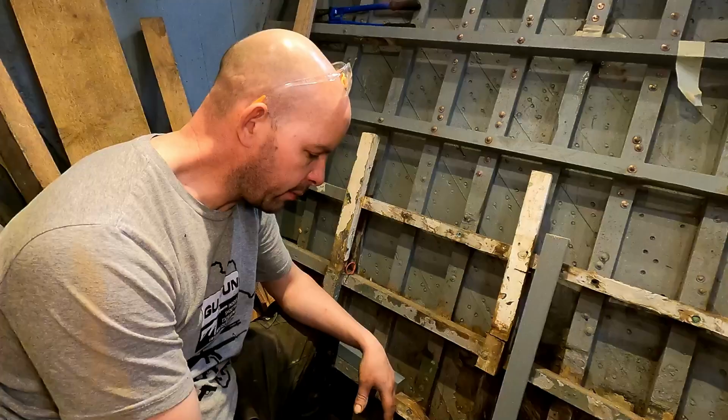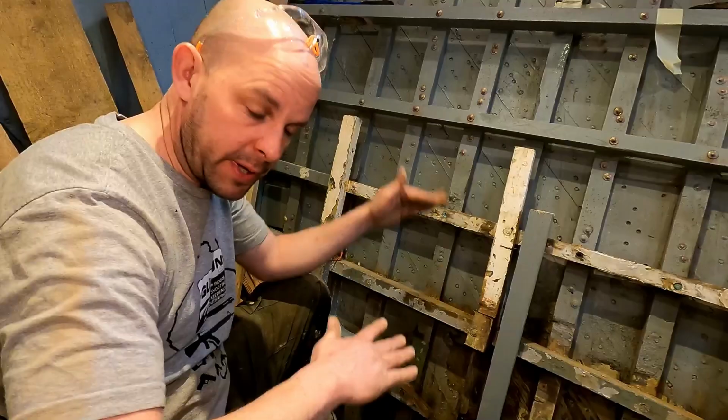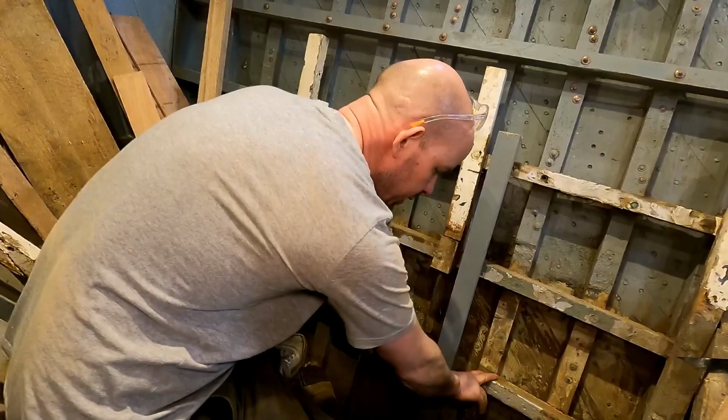So it's not completely rotten, that one, but it's very difficult to change down there because of where we are and the mud and stuff. So we can actually cut a frame as long as we can, slip it up under, and then epoxy in, and then yeah. And then Jem's going to make us a nice noggin now, aren't you, Jem? Yep. To go across these, I'm going to machine them back a bit more, yeah?